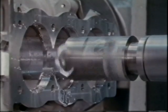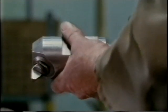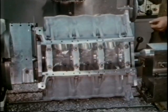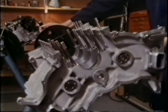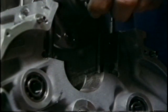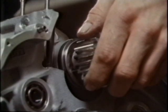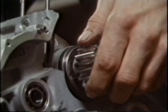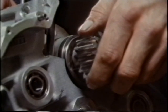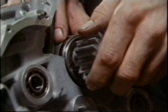Within weeks, the first aluminium castings are ready for machining. This 120-degree V6 block is turned upside down so that the crankshaft can be eased in. If you're not careful it's going to hit the side of the block and could cause quite a bit of damage. So you have to be very careful whilst you're dropping it in. Because of Duckworth's obsession with structural strength, the engine is not easy to put together, and there are many tricks to learn.